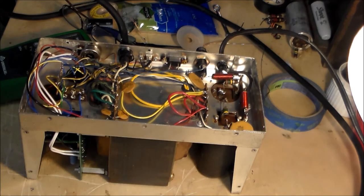High voltage, 650 volt test. So, here's where another disclaimer comes in. This is for a tube transmitter. Tubes require high voltage to run, by and large. So, there are lethal voltages circulating in that circuit right now, and we need to be extremely careful, because while you guys might enjoy watching me electrocute myself, I can assure you that I would not enjoy that at all. So we're going to be careful. It says the orange wire should read at least 650 to 750 volts.